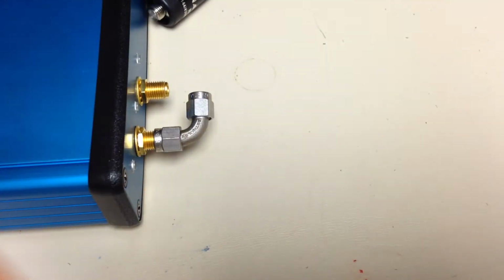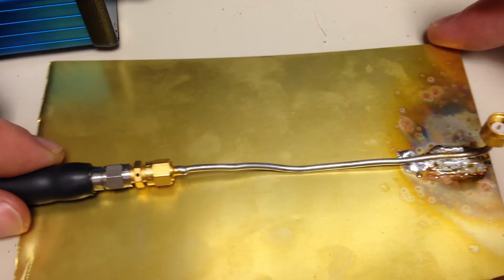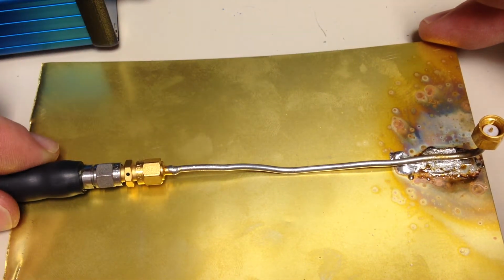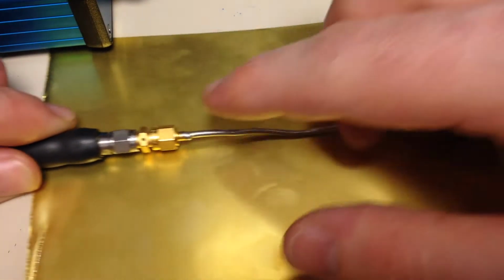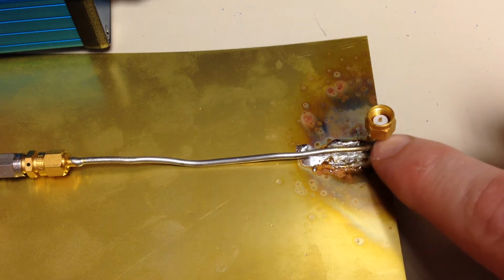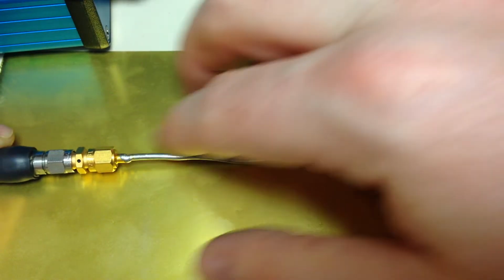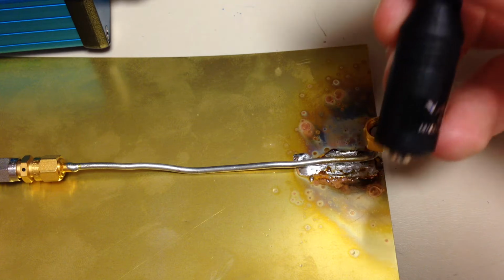So what I'm going to do is I took and made up this piece of brass shim stock right here. It's about the same dimensions as the Ettus B200, about 6 inches long, 4 inches wide. I've soldered on this length of SMA .086 rigid cable, male to male. So this simulates the B200 circuit board, the counterpoise. Then we can screw this antenna on here.